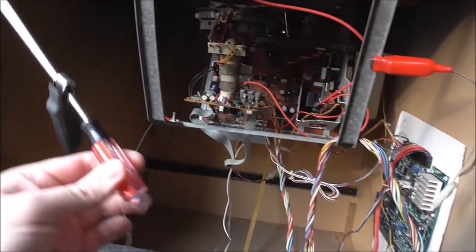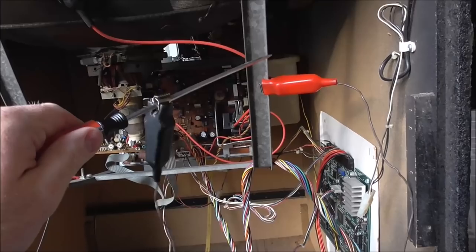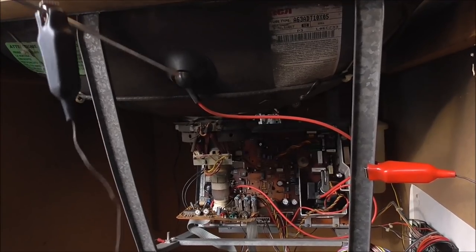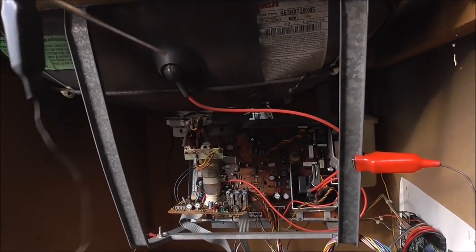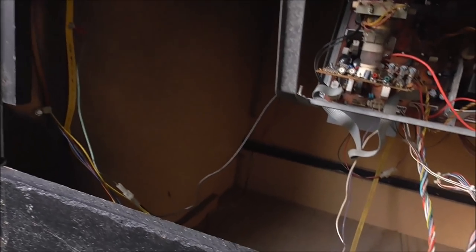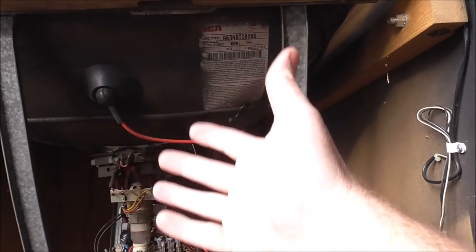It's a big jolt. So you basically want to get the voltage out of the tube to the ground. You can use a big screwdriver with a wire on it. I've got a clip on one side, the clip's connected to the ground on the other side, and you just want to slide the screwdriver down under the socket and touch the metal anode in there, the pin, the clip in there. Now, I don't think it's actually going to even have any stored up charge, but we'll see. So you may hear a pop. Nothing. So it didn't have any charge because the high voltage is not able to build up, because it's coming up and then shutting down.